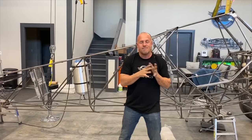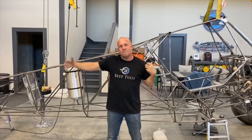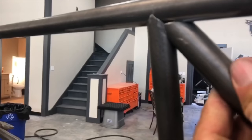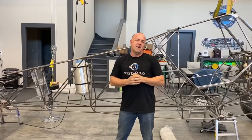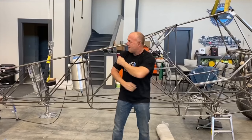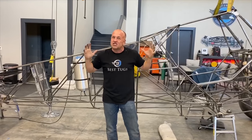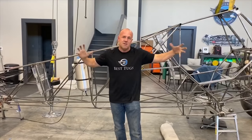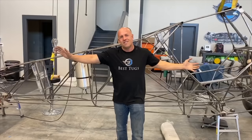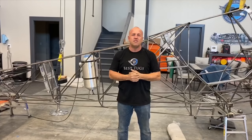So here's what I thought about doing. I could either take cross braces and go from side of plane to side of plane, from top to bottom, cross it out, and run a web through the plane and take that twist out. Unfortunately that would go through my baggage area, through other areas where my gas tank is, and it would just add a lot of weight. So I could go to another way, which would be taking a giant carbon fiber tube - go from the front of the plane right at the firewall clear to the back, make a bulkhead at the back, two flat plates with a tube between them. Tubes are extremely hard to twist, so a carbon fiber tube would lock the frame down and weigh very little. The downside: it'd go right through my storage belly pod I just made.